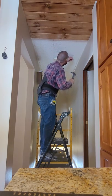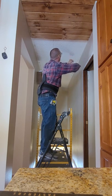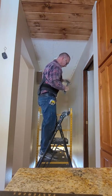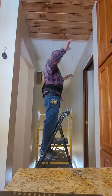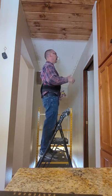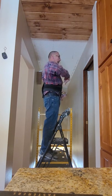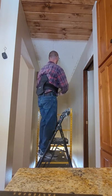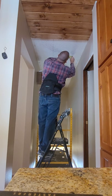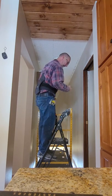Again, I'm checking for center. I just go a half inch outside of it. Nothing. A lot of times when they span trusses, that's the edge. When they span trusses from end to end of the house, there's no header, obviously, you see, so these are just a truss roof system. I mean, they try to keep things, you know, 16 on center. This house, the trusses are 16 on center, which I was so surprised, but then I started thinking about the snow that we can potentially have.